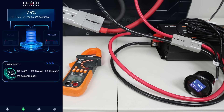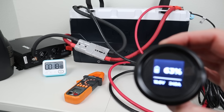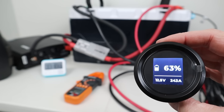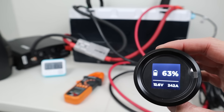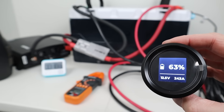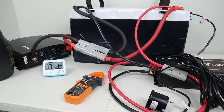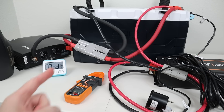The smart app also reports the same amperage — just over 3,000 watts. I let the test run a bit longer than 15 minutes to account for setup time, and we have definitely been at this load for 15 minutes. We're still pulling 245 to 250 amps and dropped from 76% down to 63% state of charge even with this ginormous load — showing just how capable this battery is for running large loads or extended run times.